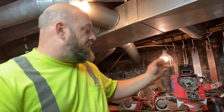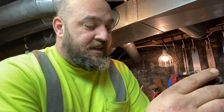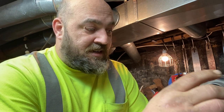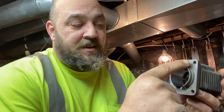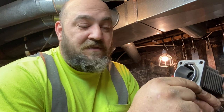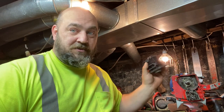Let's talk about the squish a little bit — let's pull this cylinder off. This is the cylinder we're working on. The squish is the distance between the top of the piston and the top of the cylinder. One way to change your squish is to put the cylinder on a lathe and machine enough off the base so that when you bolt it on the whole thing sits down a little lower. That'll pull your piston up higher, closing your squish off and increasing compression. With this particular saw, a lot of folks will find that if they try to do that, they're going to free port — so this is one thing we need to take into consideration.